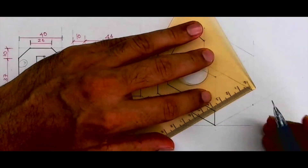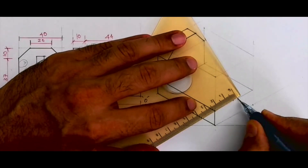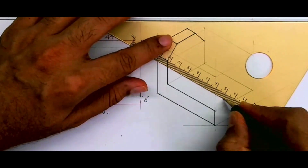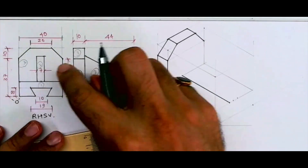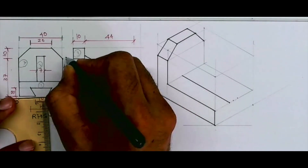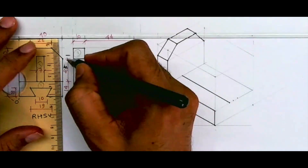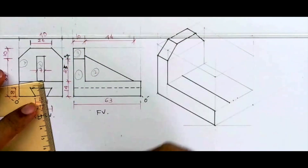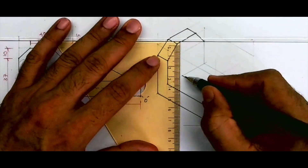After that we'll draw the slope before the slot. It is the midpoint — take 3.5 on each side, then extend this line. Now this height is 25. Earlier that 25 marking was for that height, so I'm taking 2 mm from here. This is 14 plus 23 plus 2 — that way you can take it. From the bottom, go up by 25 and join the slope.